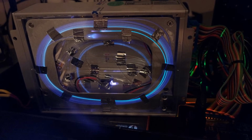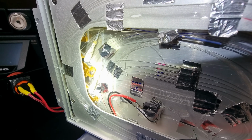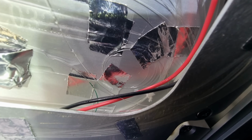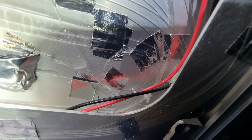I came here to find out if it's a master oscillator power amplifier or a Q switcher. The manual for some reason mentions both technologies. It's tandem pumped by 3 18-watt fiber-coupled diodes. And over here we've got a... oh no, I hate this. I hope that's a strategic, intentional bend radius violation, as an attenuator or filter, and not just a way to tug away some extra fiber.